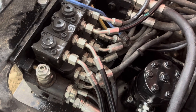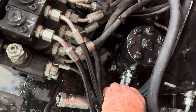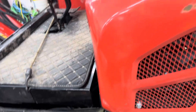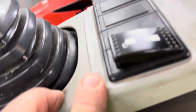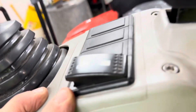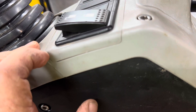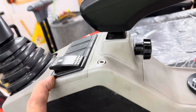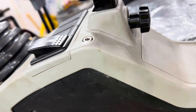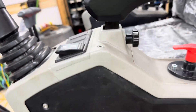Almost got it back together — taking off this hose and this hose makes it a lot easier to get out. Alright guys, got the FF-15 done a little work today. Basically what we had to do is unplug it and plug it back in and the hydraulics would work for the controls up here. The last time it gave us trouble we wound up pinching the terminals together, and so far I think it fixed it. Just these top screws — lift it off, take that off.